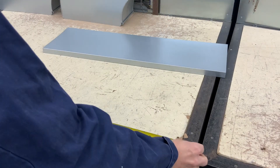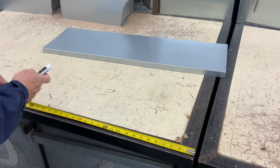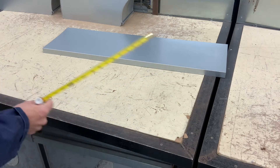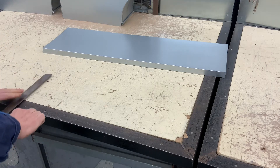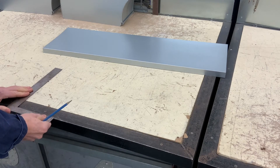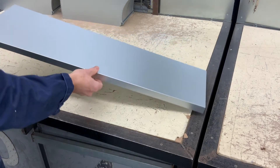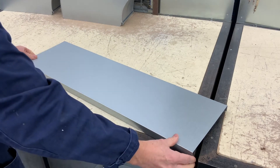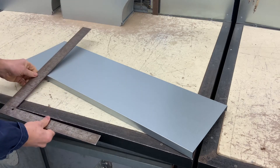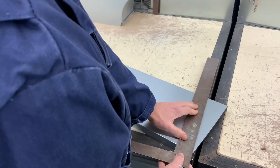For this demonstration I have chosen a panel of metal which represents a piece of duct. Here you see me marking 26 inches long, 7 inches offset. On a job site you will always find an area where there are perpendicular lines. So go to this area and position your ductwork in the same manner of length and offset required. Once you have that, draw your lines to create your miter lines.